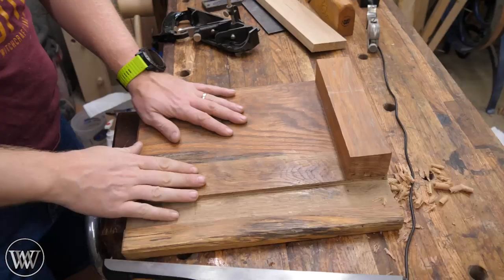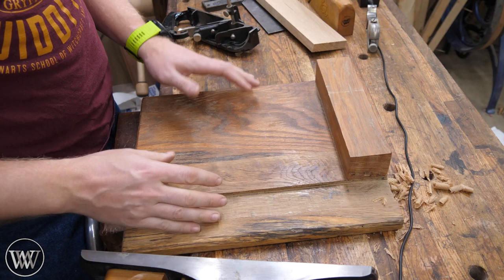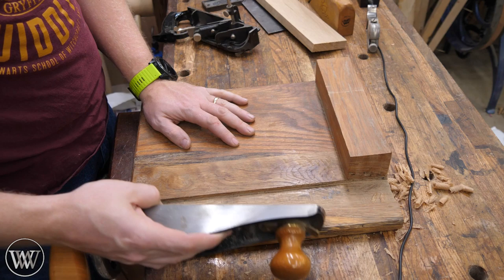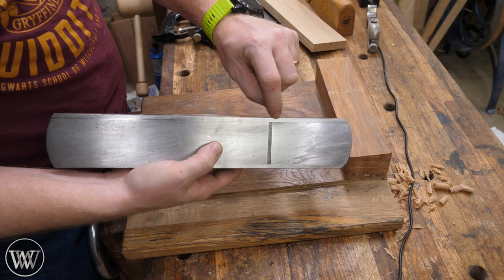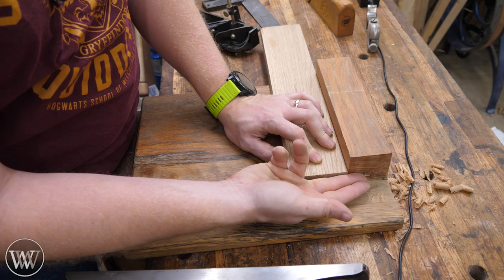Some shooting boards are really fancy and they'll have a groove or even something to hold onto the plane so it slides perfectly and smoothly. But a lot of them are really just a bench hook — even without a groove — that allows the plane to slide beside. As long as there is some small ledge for the lip of the plane to ride on, it won't keep eating into this. And having this fence on here will stop the wood from tearing out, so as the plane ejects out the other side, you won't get pieces breaking off the back.